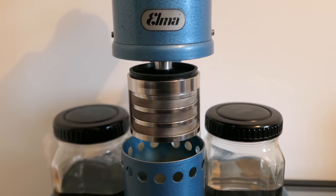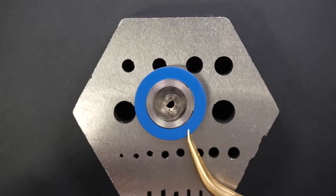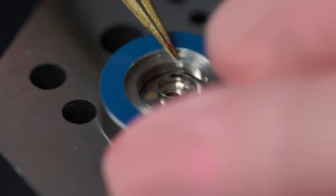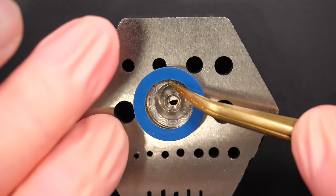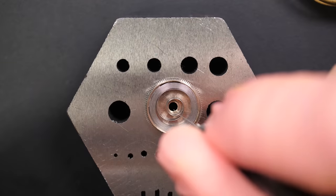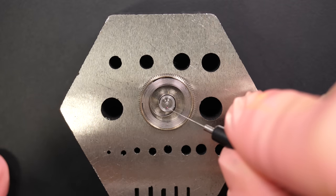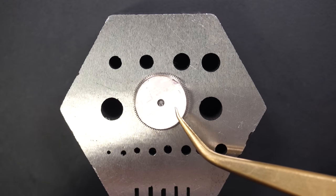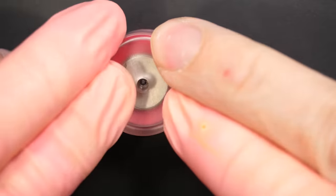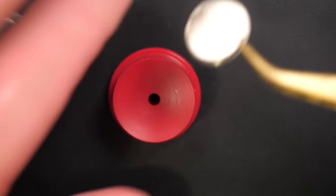The parts are clean, rinsed, and fully dry - we're ready to put the watch back together. First I will install a new mainspring, which comes in this blue disc; the colored side always goes on top. I insert it in place but you see some residue there - that's not good, so I remove that with Rodico. You don't want to leave any residue in your barrel assembly. Lubricating the holes, putting back the barrel arbor - it's easier to put back than to remove. Now closing the lid on top using the Horotec barrel closing tool, which is very handy.